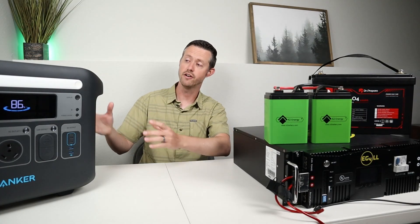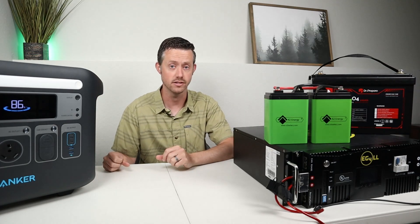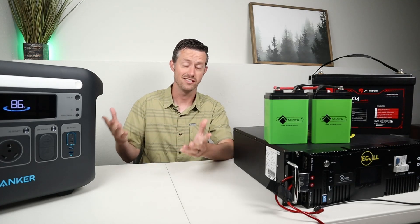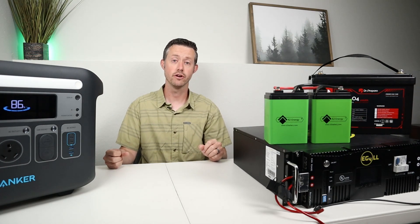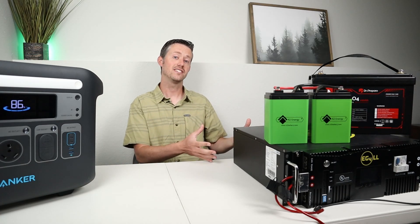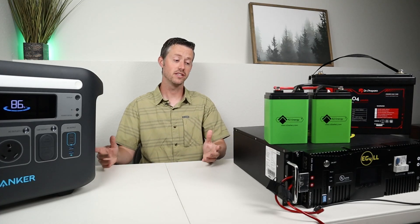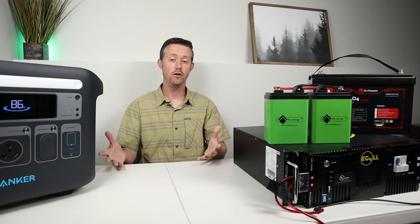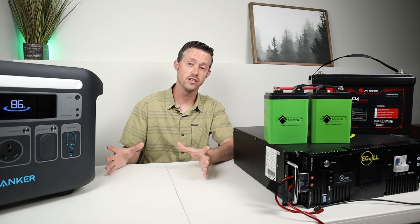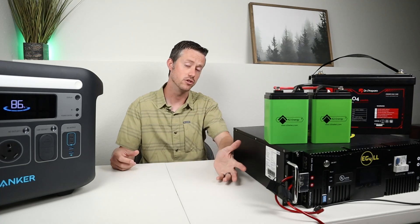The concept behind this video is fairly simple. Let's say you have a large power station, the state of charge is near zero percent, it's about to shut off and you want to keep running your appliances. There's a power outage, you can't charge via AC power, solar is not available because it's dark or cloudy outside, and you don't want to run an AC generator. So if you have these batteries laying around, how fast is it going to charge when you plug them into the charging socket on your power station? The benefit to a standalone battery is that they are fairly affordable versus a power station, and you can use them for other systems in the future. The key part in this video is what happens with different voltages and how fast it charges with a 12 volt battery versus a 48 volt battery.